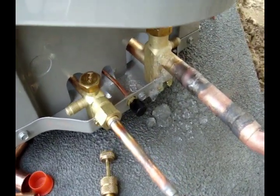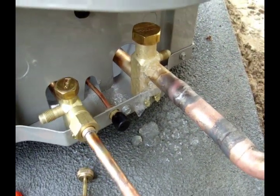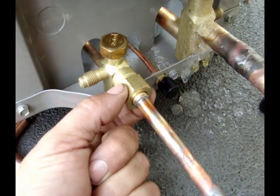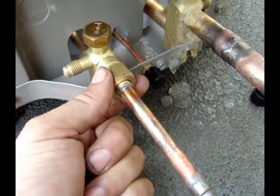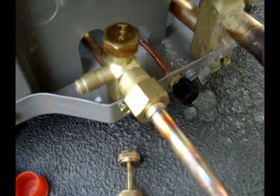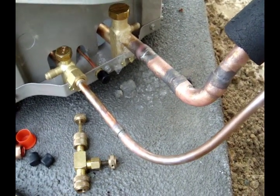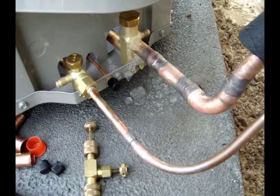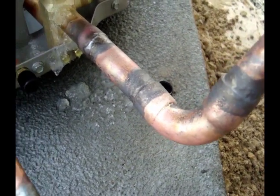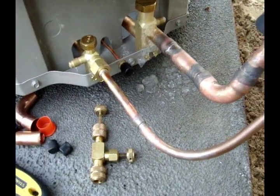Condenser's brazed in now. I had removed the valve cores, everything's cooled down, so I put the valve cores back in. That gel stuff is cool gel that I put on the service valve just to stop from potentially cooking it. On the liquid line I just have it loosened — took the gasket out and had it with about one thread so it's in place while I braze the line. Once everything cools down I put the gasket back in and tighten the fitting down. You can see the brazes — I'm sure there are people that can do much better, but I think they look pretty good, and no leaks is a good braze as far as I'm concerned.